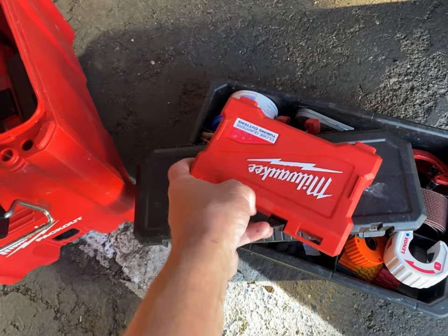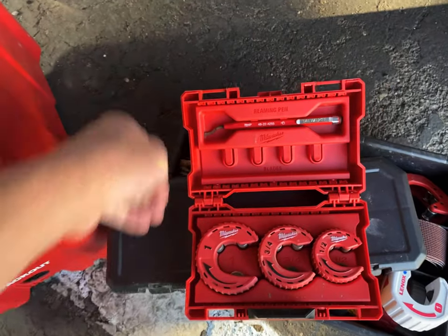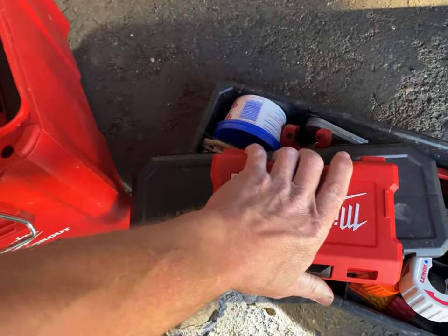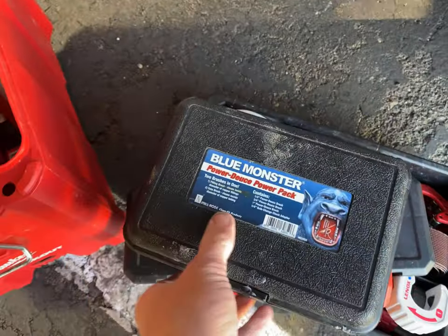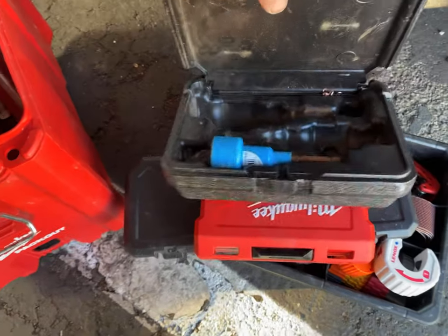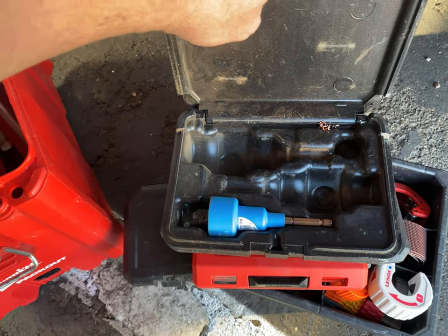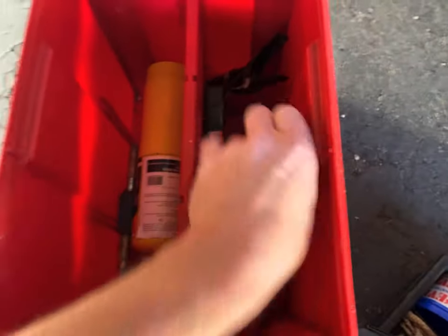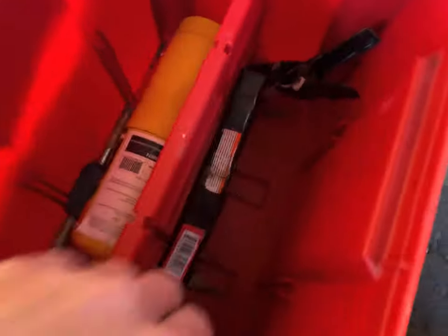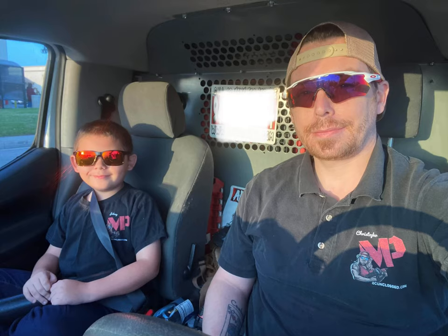This is my favorite close quarters kit, the Milwaukee, but it doesn't last very long unfortunately. And that reamer — I love the Milwaukee reamer, I have like 10 of them. This is the Power Deuce, this is what I used to use — they're a drill attachment for inside and outside for cleaning copper. But now I use the kit from Wicked. There's my little roach clips for prefabbing and my Goss quick igniter.